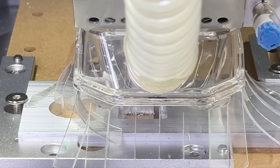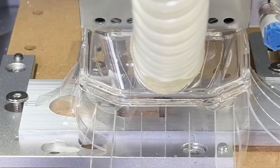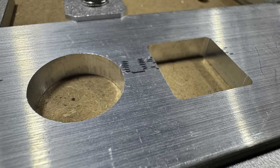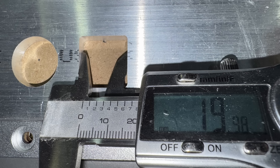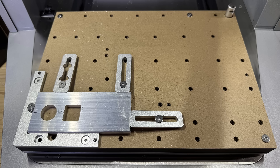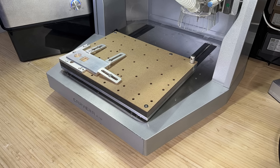At the end of the job, you can see the dust collector can even suck up a piece of thin aluminum, which is considered large debris. The finish of the pockets is clean. I also checked the accuracy — the 20 millimeter square is very accurate at 19.98 millimeters, and the circle measures at around 19.95 millimeters. For the dust collector, it works similar to the wood test, with only minimal debris escaping from the dust shoe. We have some debris across the bottom of the machine, but the table is still pretty clean and I don't need to clean it up at all.